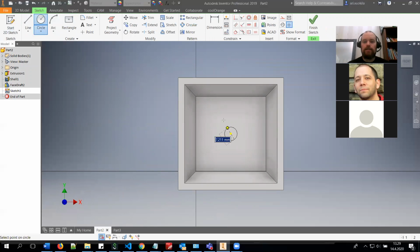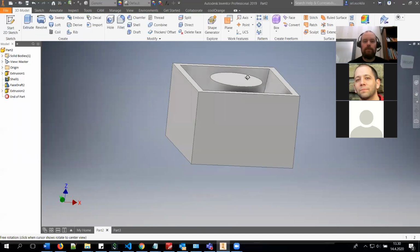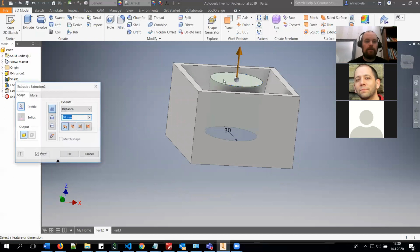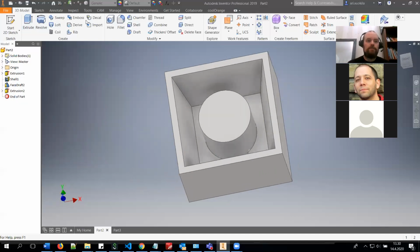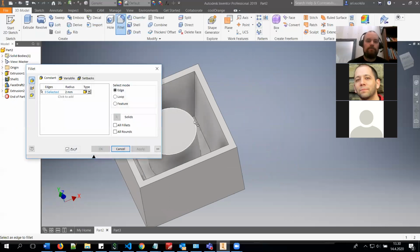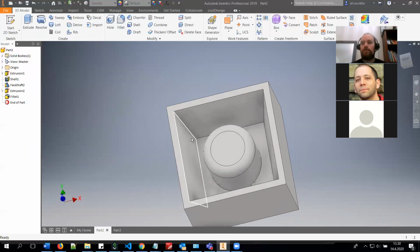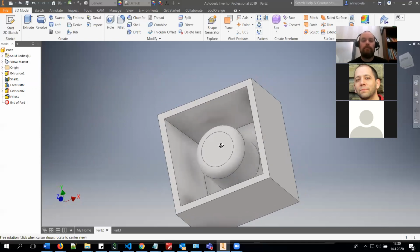Then you can just put your path, or you can actually design this also around your path, but let's say this is then a 30 millimeter piece. It can be something simple, for example. Of course, it cannot be as high as the mold, but let's say 25 millimeters. And now you have this piece in the mold, and because this has to be at least 3-axis finishing, you can, for example, create a 5 millimeter radius fillet around it, and you will have this part. So this would be, for example, a one-sided mold that is already acceptable for this course.